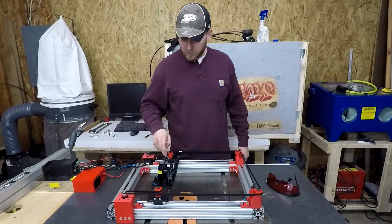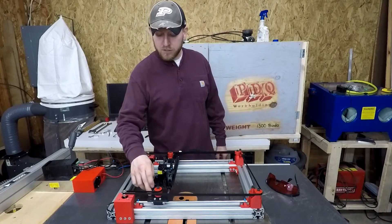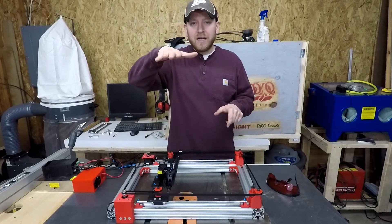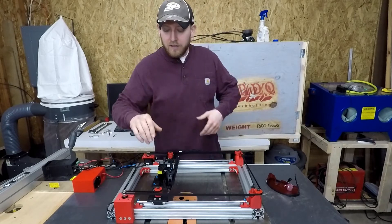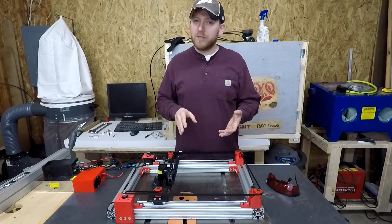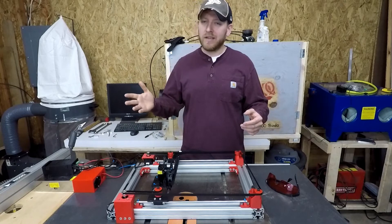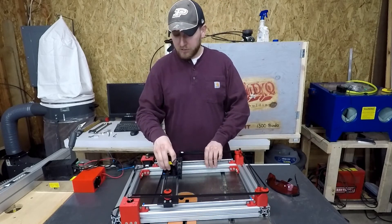The black material you can see versus the red material is basically a version two — I had to make a couple modifications. When I first did the carriage that rides on the X-axis, I just had that supported basically with a U on there and zip tied the rods. That allowed it to shift down as you tighten this, and it put too much of a load on these pulleys. It made me pretty nervous. So I changed it so it fully captures the rods. Now if you have any kind of misalignment, such as one rod a little bit further in, you will have a little bit of trouble moving this back and forth as you get closer to the edges.